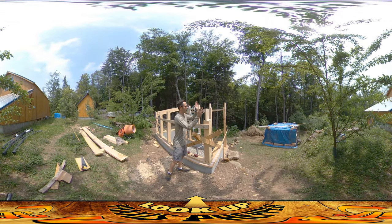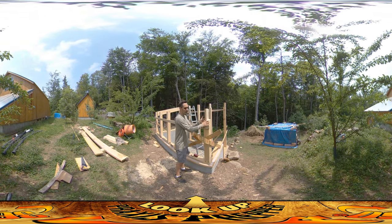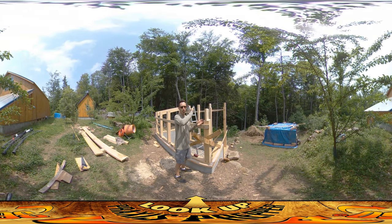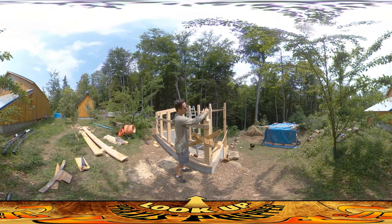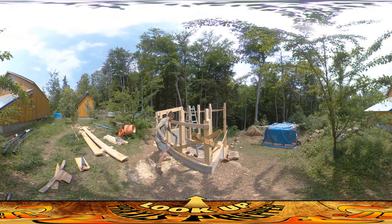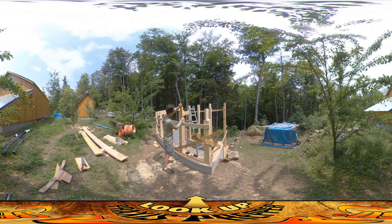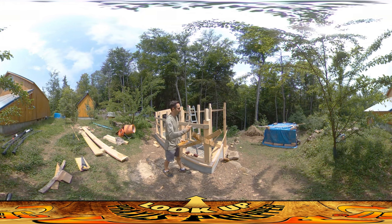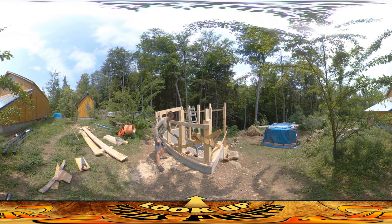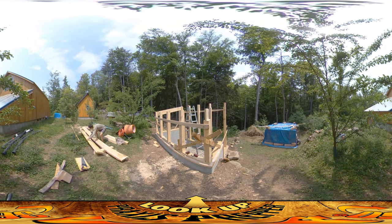Okay, so we're doing the rafters today. You can see I've got this thing cut out. I got these all set up and marked off, then brought them down to the lumber mill yesterday when my dad was here doing some lumber for himself. We ran the lumber mill and made these two cuts, and after that I made this little template. The template went on at this particular angle and I was able to mark the angle of all the side cuts, then I did the side cuts — started with the power saw and finished up with a manual saw — and made this first piece right here.